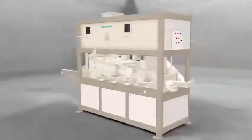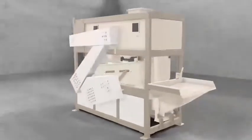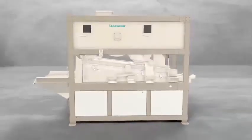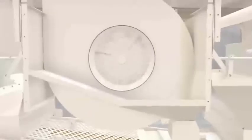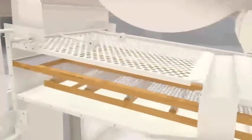Deluxe 2 is a robust machine of all-steel construction, covered with steel from all sides with a bolted structure. It has balanced aspirator fans and stepless variable air controls. Specially designed nylon brushes are provided to prevent sieve perforation clogging. The sieves have a large perforation area and can be easily changed. The air chamber, sieve deck assembly, and spouts are all of self-cleaning type.